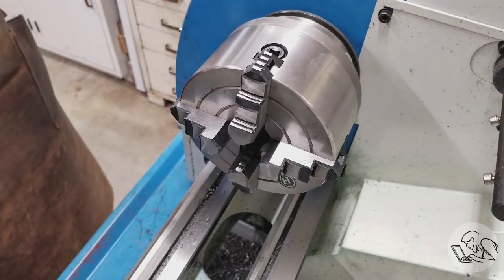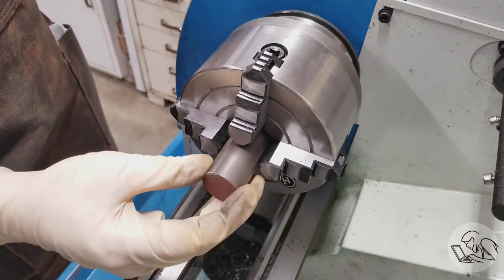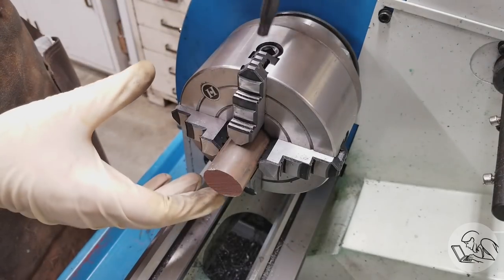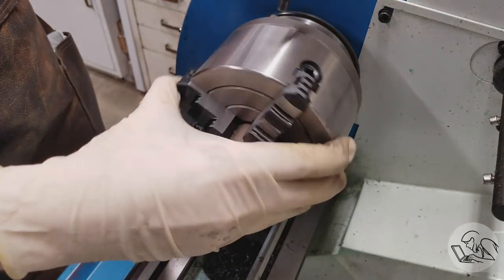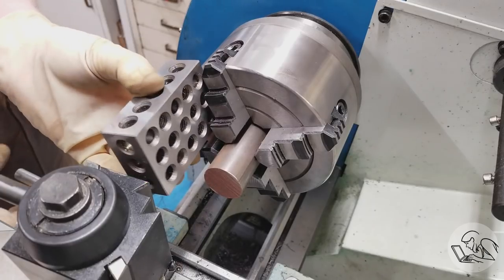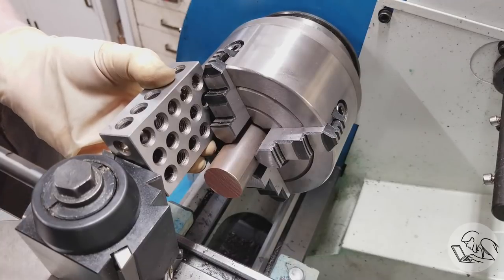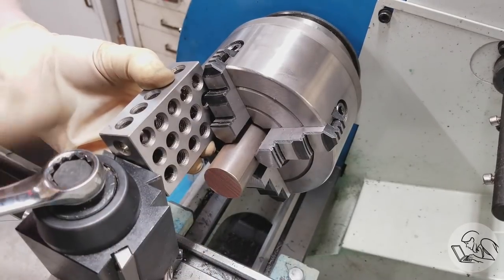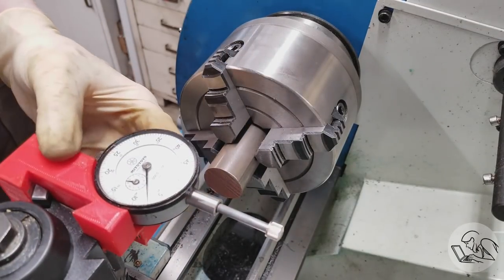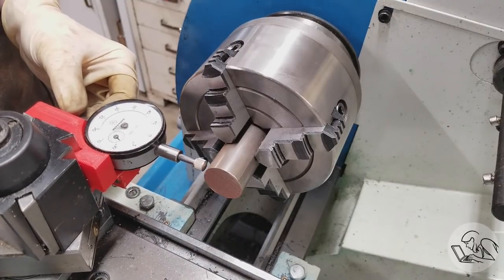Let's get this stock in the lathe. I'm going to do this all in the four-jaw, but you could definitely do this in a three-jaw chuck even though we're going to be flipping the part end for end at one point, because this is a camera mount — it's not a high-speed spinning mechanism — so maintaining perfect concentricity is not very important. But I'm using the four-jaw so I'll square my tool post and get my 3D-printed indicator mount in there. If you want this 3D-printed indicator mount, I'll put a link down in the description. That's on Thingiverse, and this is my design based on an idea from Mr. Pete — so thanks, Mr. Pete.